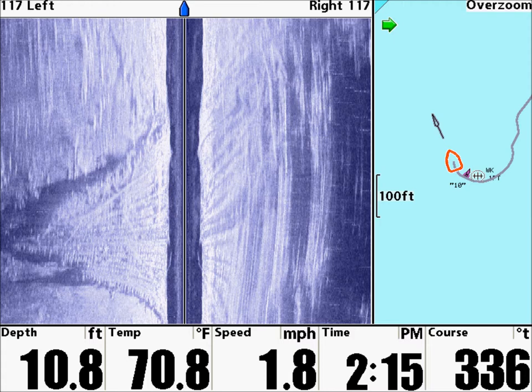The second setting is sensitivity. I'll drive over some kind of object — right at the launch ramp is a good spot because you can actually see the concrete of the ramp on most side imaging units. I'll turn my sensitivity up high enough that everything looks sharp and crisp but doesn't start to over-brighten and blow out. If you turn your sensitivity too high, you'll see the rocks and everything will just get too bright. Come down one click on your sensitivity and you're set just about perfect.